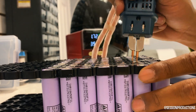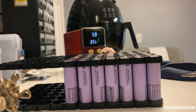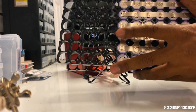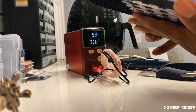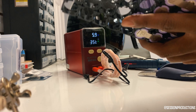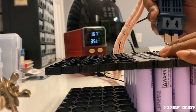Sometimes you've got to use the spot welder to get the nickel strip into a good position to get a good weld on it, so it lays flat and keeps a nice clean look. As you can see, one set of parallel connections is done, and then you're going to flip to the other side and keep doing this whole thing in series — going from side to side until you're done with the parallel connections. You'll see I'm on the next side, going off the last negative and putting it into another one; that's how the cells just keep going.